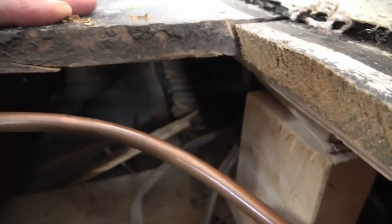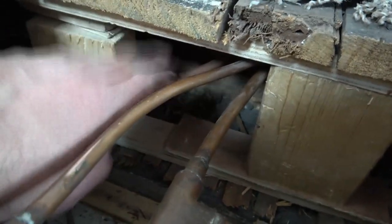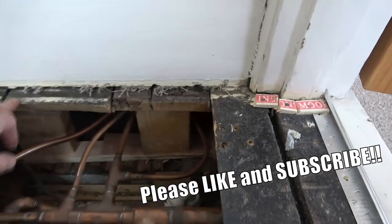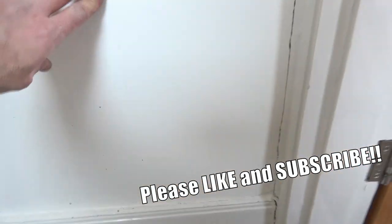This is purely supported on these floorboards. If you look down there you can see the void and there's a joist just in there, so it's not even supported on a joist specifically — it's relying on these floorboards. Now before I bought the house, a plumber had obviously come in, done all this plumbing work right here, and cut through these floorboards. These are providing a little bit of support for the brick wall above.